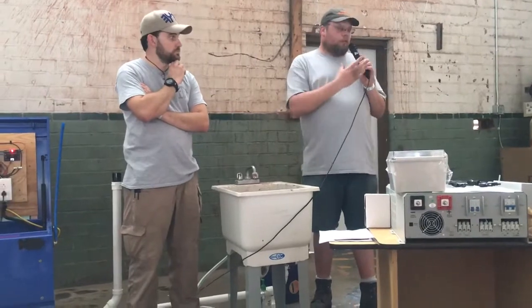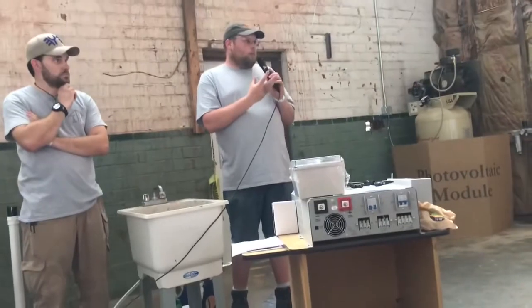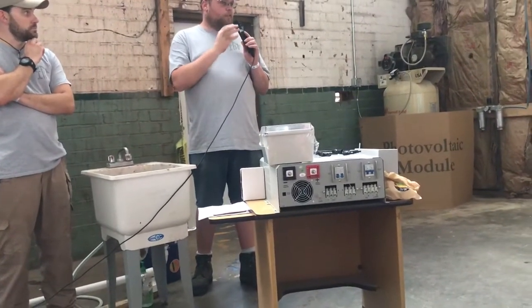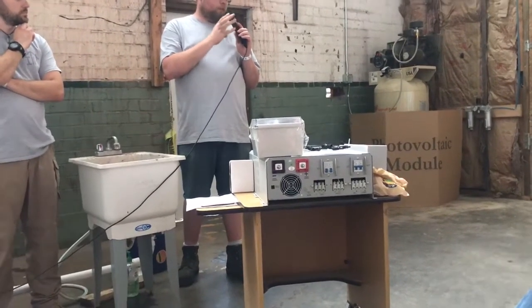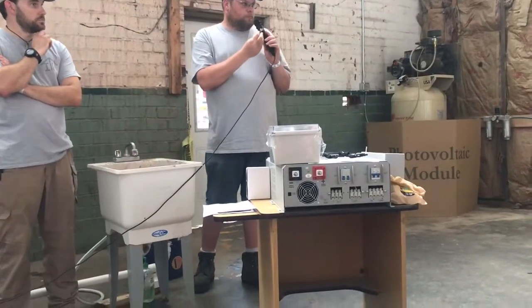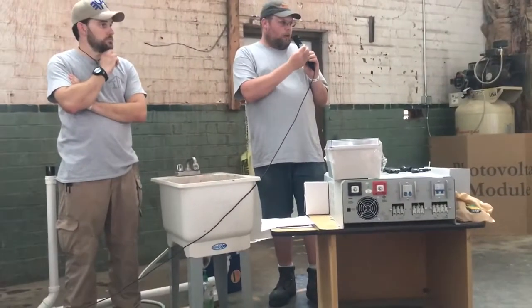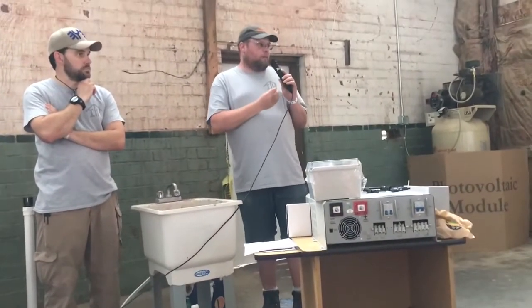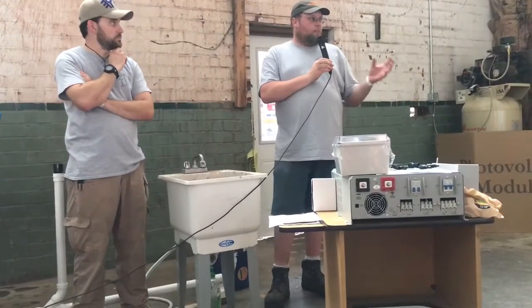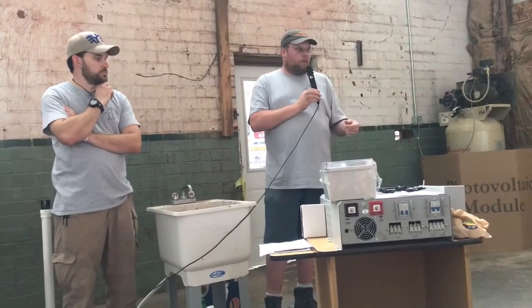That's why Lucas was talking about the water heaters. If you use a tankless, it doesn't hold water. The tanked water heaters that hold water, while it's sitting there, because of the way it gets filtered, it loses oxygen in the water and it makes that smell. And some of the chemicals that go through the filtration system will help with that smell. So the more we keep up with the filters, the less of that might bypass. So any hint of anything different, that's the time to go and check it out.